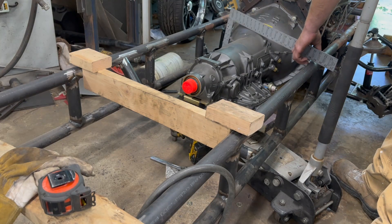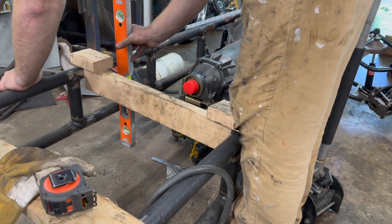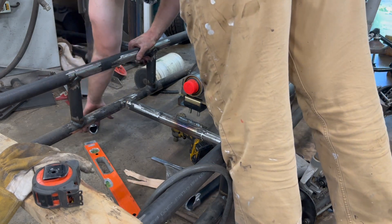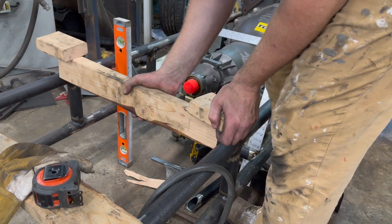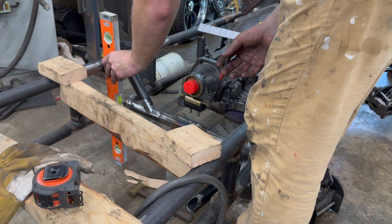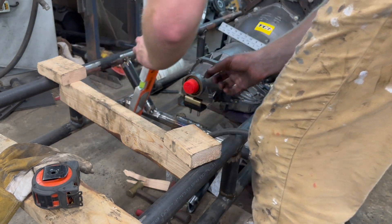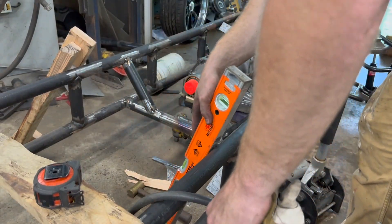What we can do is make sure our side rails are plumb. That one is not perfect back there so we need to get them perfect up here obviously. I'm going to get a hammer. It's good on all your levels and everything if you drop them a bunch. I need to put some pressure on this, just a wee bit — like so. We're good there. Make sure this is plumb, mark it. Good there. Double check that way — beautiful. Let's tack this old dude in place. A couple of tacks — everything's still good. Beautiful. Check this direction — pretty darn good. Still good up here. I believe that's it.